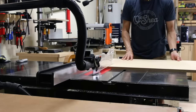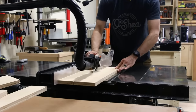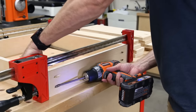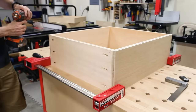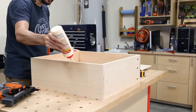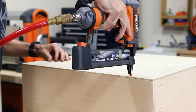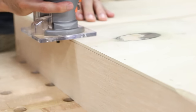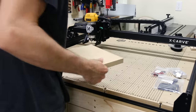Next I got to cutting the parts for the drawers — two shallow drawers on the left and one deep drawer on the right, so I cut parts for six sides and their fronts and backs. The drawer assembly is straightforward using pocket holes on the fronts and backs. I've actually gone to an even easier method than my previous DIY drawers video: I no longer cut grooves in the bottom to hold the panels. I just go with a full sized bottom panel that's glued and stapled to the bottom. This approach lets you square the bottom with the panel and holds it in place permanently with no rattling. Then I use a chamfer bit in my router on the sides of the drawers to hide the plywood bottom from sight.